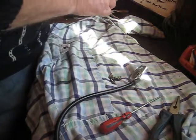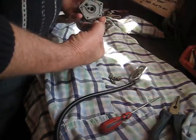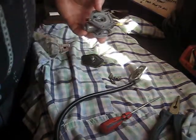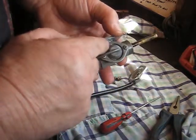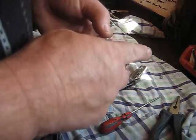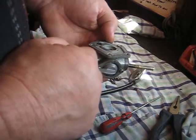Not really a great fan of these things, but there you go. If anybody's wondering how they work: you've got an on position, a reserve position, and a prime position. When the fuel is on in the on position, petrol goes down this big tube here, comes out of this hole here, goes into that hole into the fuel bowl at the bottom.